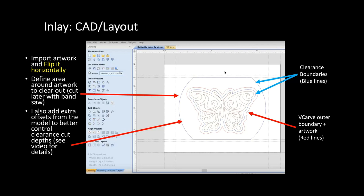And so that very first pass could be three times what you're used to using on a plunge or on a straight bit. In some machines, that's no problem. In some woods, that's no problem. But that's one of the lessons learned. I learned pretty quick that in really hard woods, that was too deep.